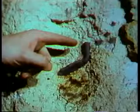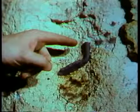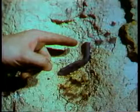Another problem that can show up in the ash hopper is erosion of the refractory. Anytime water flows over refractory, there's the possibility of erosion. Be sure to check the general surface condition of all of the refractory inside the ash hopper. Things to look for include spalling, cracking, and erosion. Also, if you can see refractory anchoring devices at the refractory surface, the refractory is either badly worn away or was improperly installed. Previously repaired areas must also be checked when inspecting the ash hopper.